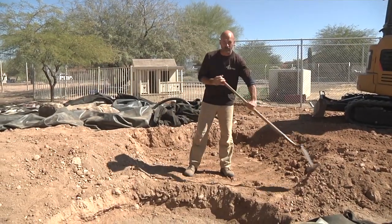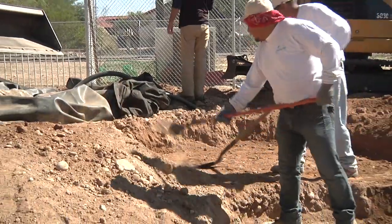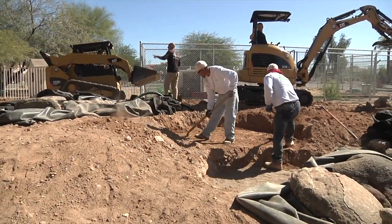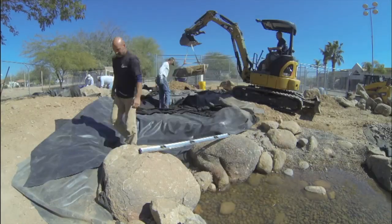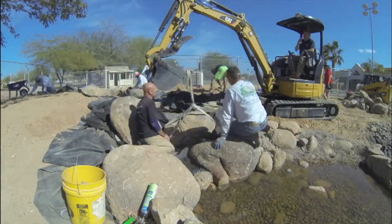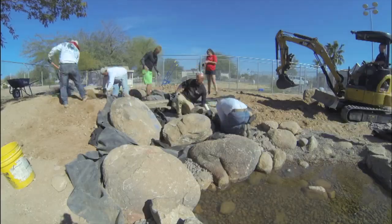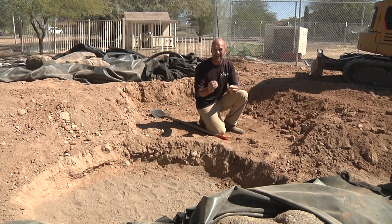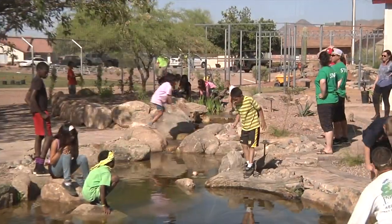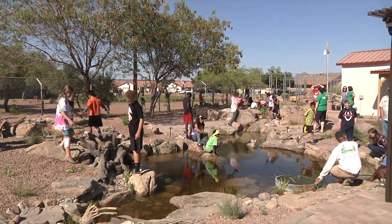This area may look huge for the waterfall, but it's going to look completely different when we're done. What we always do is over-excavate the area. The reason is we're going to place big giant boulders in here, and we want the rocks to fit right. We don't dig the excavation and fit the rocks to it — we over-dig everything, place the rocks so they look right, and then backfill behind those rocks with soil. This is a very organic process that gives us lots of flexibility. When we're done, it's completely transformed, all choked down. This is going to be an interactive stream — big giant boulders where kids can hop in and out and really have a good time with the water.